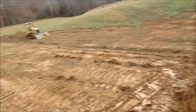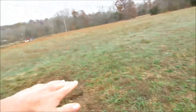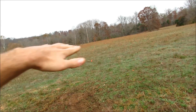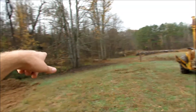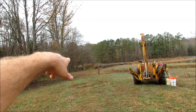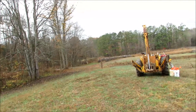Then as the pond fills all the way up and there's too much water, there's going to be a spillway down there that will allow the water to remain at a certain level — wide enough to handle the flow. It'll flow across the field and into the next swale, where it will exit into the ditch where the original water was going in the first place, and under the road and down to the lower field where there is another big pond. The spillway goes off into the lower field, which is relatively swampy and wet, and after that it filters down into the creek.